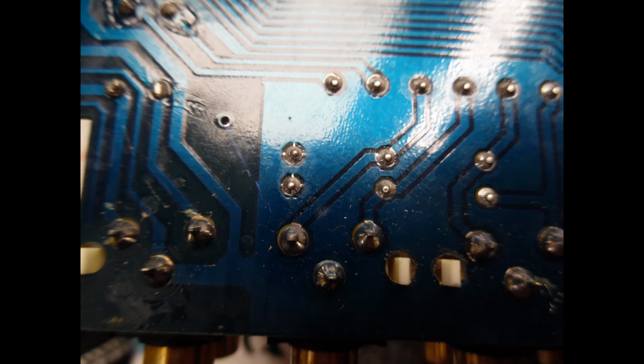So what I'm showing next is the solder side of the circuit board, and what I think here is that this became a secondary issue due to the primary issue, and I'll elaborate on what I mean. The secondary issue was caused by what the actual fault was, which was a faulty RCA socket. The contacts inside the RCA socket at some point were making an intermittent connection with the plug, and I figured that maybe the owner found this an issue and then put some extra mechanical stress on the leads trying to find out what was going on, and that created this second problem. This is not uncommon. What I'm showing here, and it's probably not immediately obvious, is that there is cracking around the circuit track, to the point that on one or two of them it had almost broken away from the board.